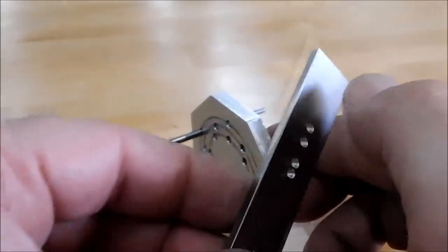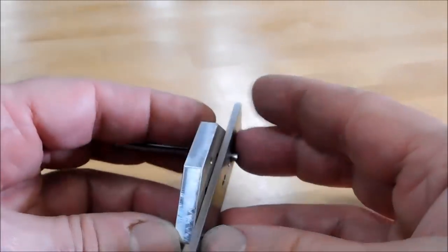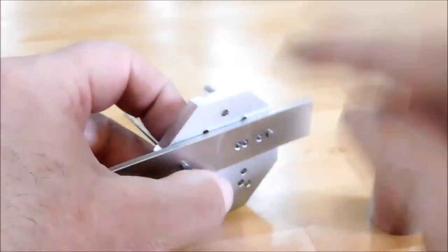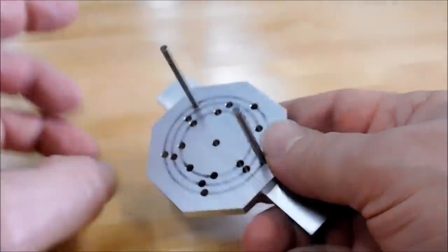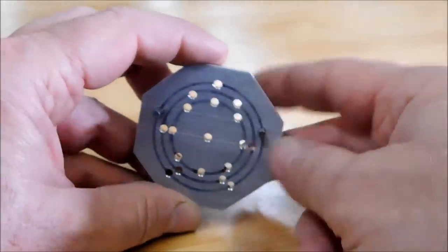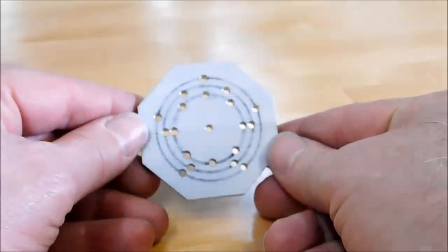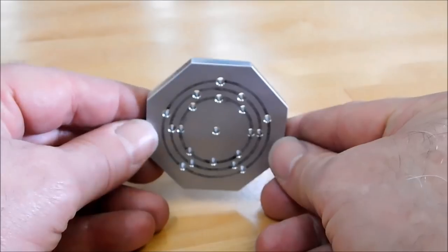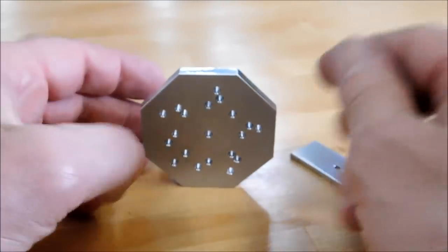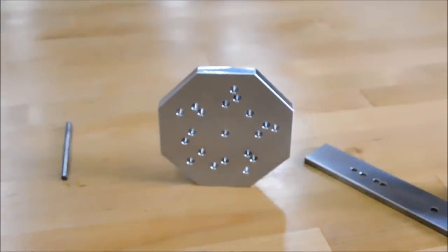There is also an outrigger bar I've created for this unit. That gives you a nice long surface to run an indicator on if you don't want to bounce across a couple of pins. The way these holes are drilled, this bar will work with any hole pattern on this. It offers you a square pattern, an octagonal pattern, a six-sided hex pattern, and a pentagon five-sided pattern. Each of the patterns can be flipped or rotated to possibly double up — so the five gives you ten, the six gives you twelve, the four gives you eight. I'm going to stick that on a piece of material and show you what it looks like set up in the machine, then walk over to the Bridgeport and show you another technique.